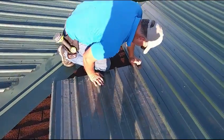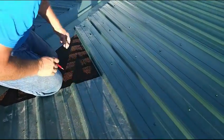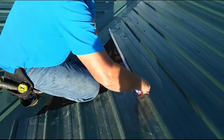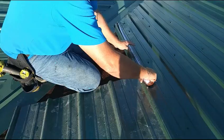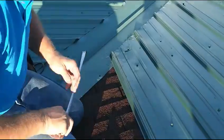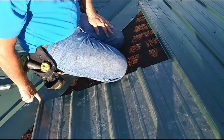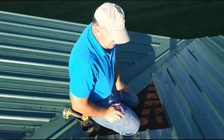When you get that, you can take a pencil and mark it. Quite often I just take a tape measure. The classic mistake — which I've done a bunch of times — is you measure on this side thinking that's what you're going to do, but you don't, because it laps over and it's got to go down to the bottom of the other side. It won't change the angle. This is a 38 and a quarter angle. So I know that whatever the length of this is, whenever it's squared across, I need to go 38 and a quarter up on this side, and then pop a line or mark a line with a straight edge and then cut across, which I'll show you.